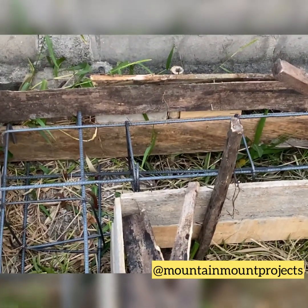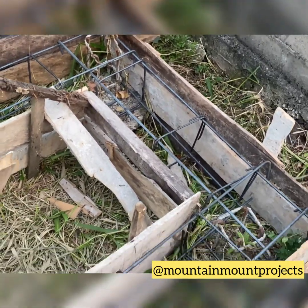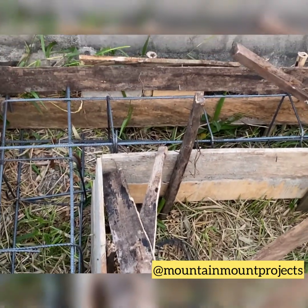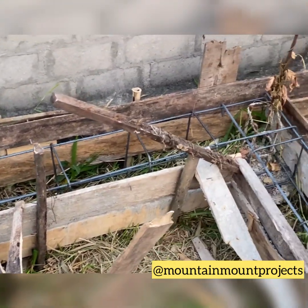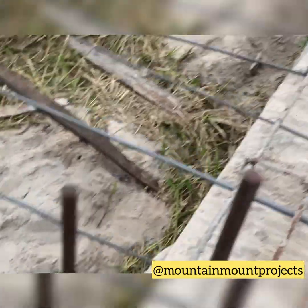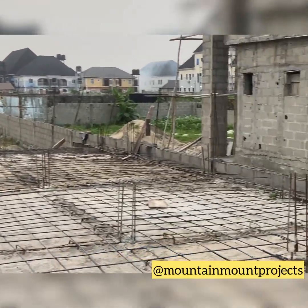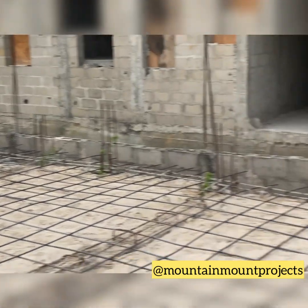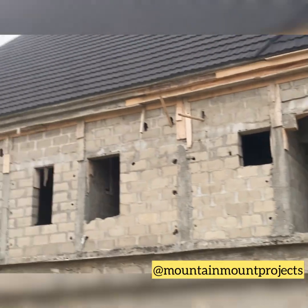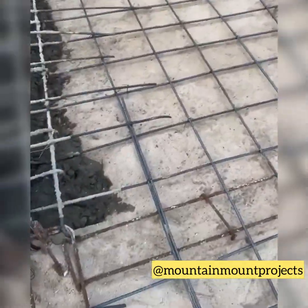This foundation needs to be really, really strong. The carpenter has done his job and the iron bender has done his job. Next we need concrete, which is granite, cement, and sand. We are ready for doing that for the foundation base and also for the flooring of the German floor for the intended one-story building.